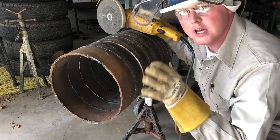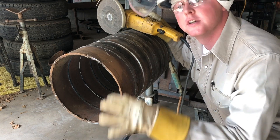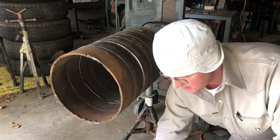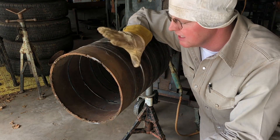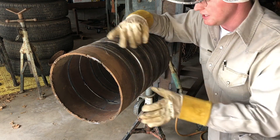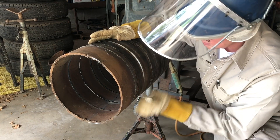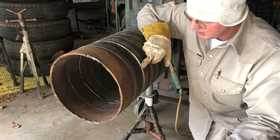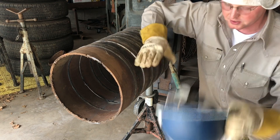Just your start, unless the welder asks otherwise — that's where you can ask him. Communicate with your welder; it's one thing that I've said in the videos before and I'm gonna continue to say: just communicate with your welder, ask him how he likes things done, him or her. See how they like their starts hit. Do that to all your tacks — depending on the size of pipe will depend on how many starts. Make sure you look top to bottom all the way around to make sure you're getting all of them.